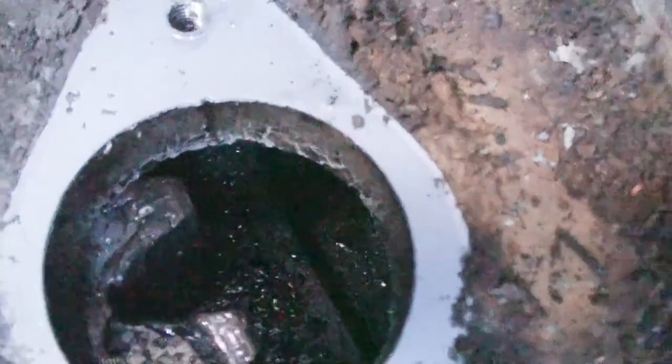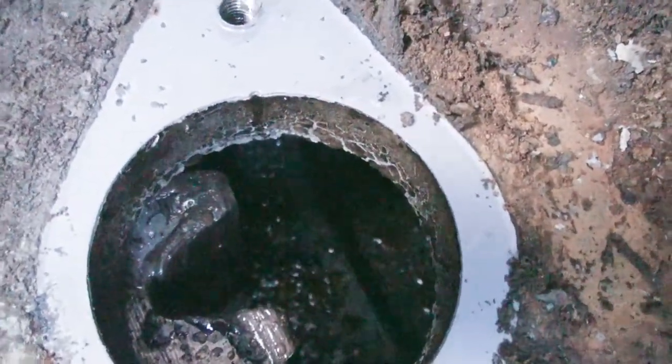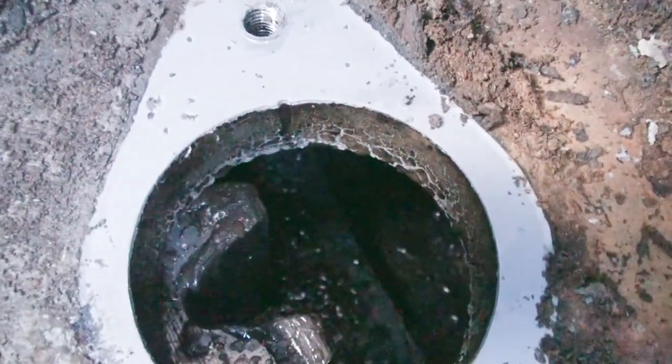There is a tub installed under the ring gear that holds grease that lubricates the ring and pinion gears of the swing system. In this case, there was nearly no grease visible at all.